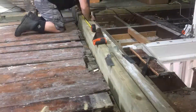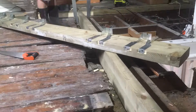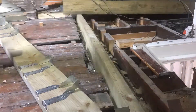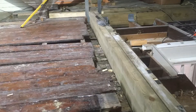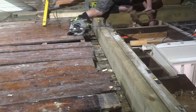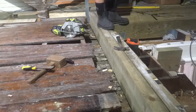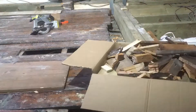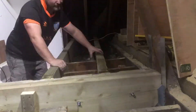Now you'll see me adding little bits of joists at the side — where the old staircase is, at the end there, I need a new pair of structural beams. The first one goes in here. I'm chopping out old roof structures and worried about the ceiling below, so I'm tying everything back together so they all support each other. You can see the joists going in off a wall plate up to the big structural beam and onto the new hangers. The other side of the stairwell will be taken care of once the new stairs are in.